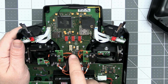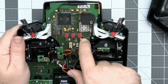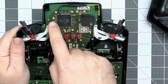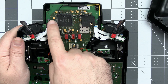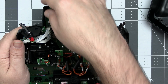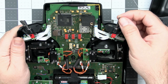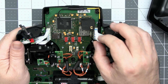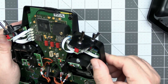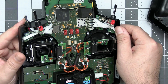This is a really super high quality PCB — you can see how nicely everything is gold-plated and how clean the lithography is. It's probably slightly oversized for what's needed, since the copper ends partway across and the rest is just laminate, possibly for stiffness. The switches are connected by flat cables, which I'm not a fan of after the debacle with the Jumper T16, but the flat connectors are at least there.